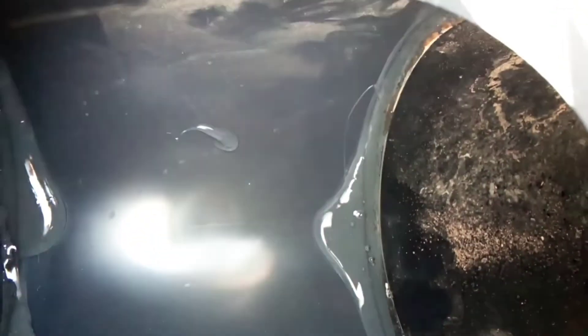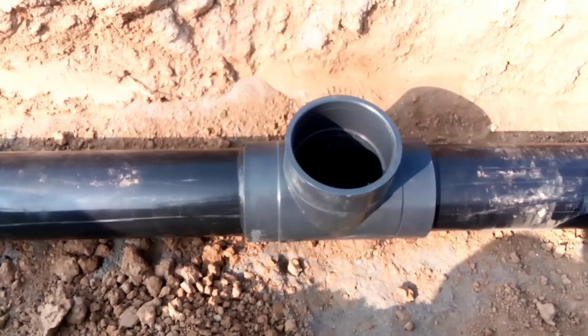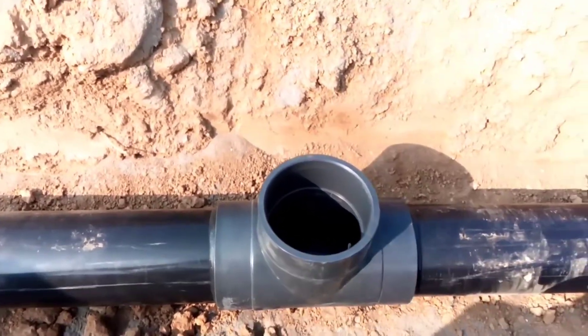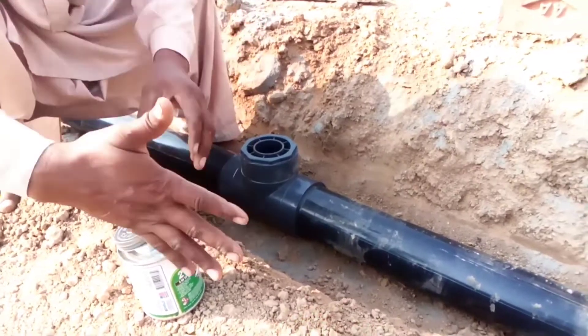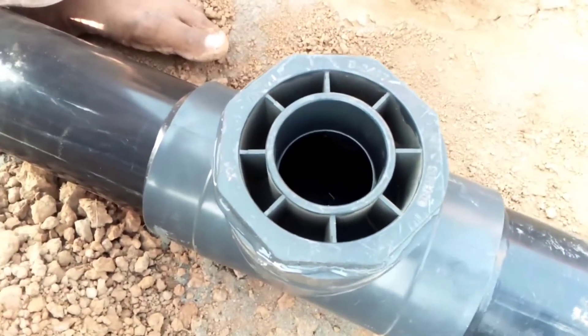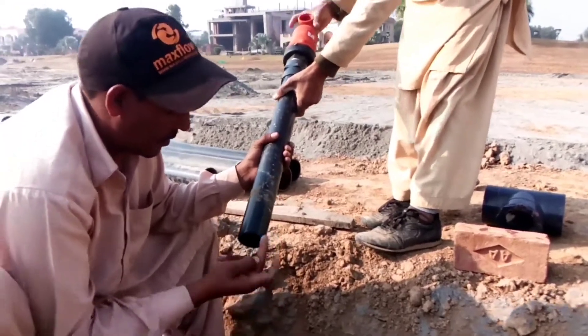Make sure there is not too much cement. Here we have some extra cement because of the chemical reaction, and after that chemical reaction the PVC thickness quality gets reduced, so please clean it before you go further. That is the reducing bush we put on top of the T — it is four by two inch — and now that piece is ready with the air release valve on.